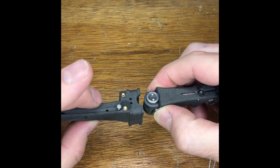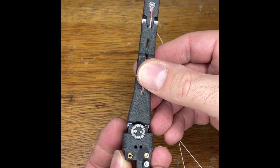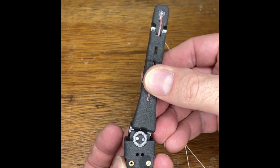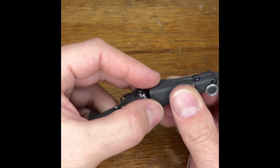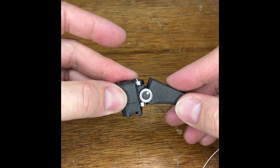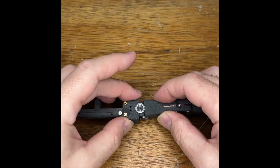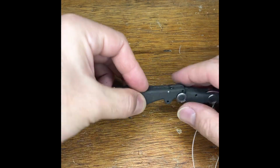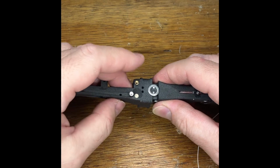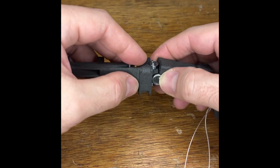And when this goes into the palm, that provides the yaw joint. So this allows the finger to move with a yaw action at the knuckle and a pitch action. And it's only held together by the same elastic element, a spring, which opens the finger. That means that in the event of an accidental collision, the knuckle can just pop apart and then go back together afterwards. No permanent damage done.